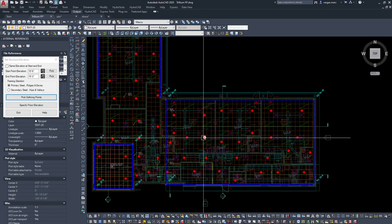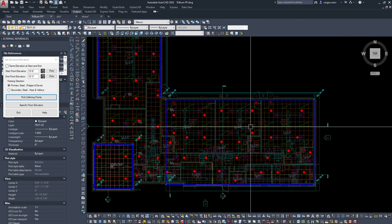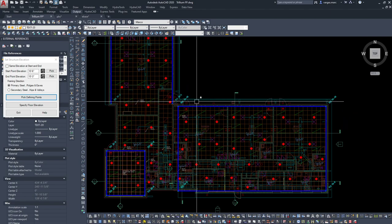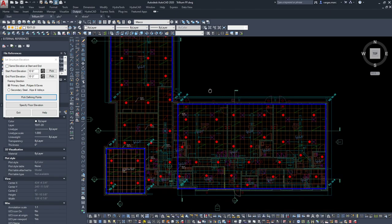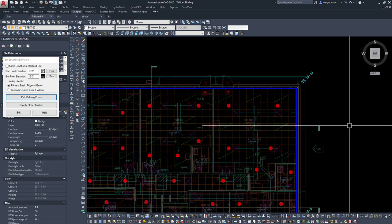All right, we're back. It's been several hours on my end. I decided to go with standard spray sprinklers because it was only going to save about four or five heads overall using extended coverage, and some rooms were better off with standard anyway. Ordering two different kinds of sprinklers just wasn't going to be ideal. I like to keep things simple — limit the types of sprinklers on the job site — and that usually ends up producing a very decent install. So we went with standard spacing.